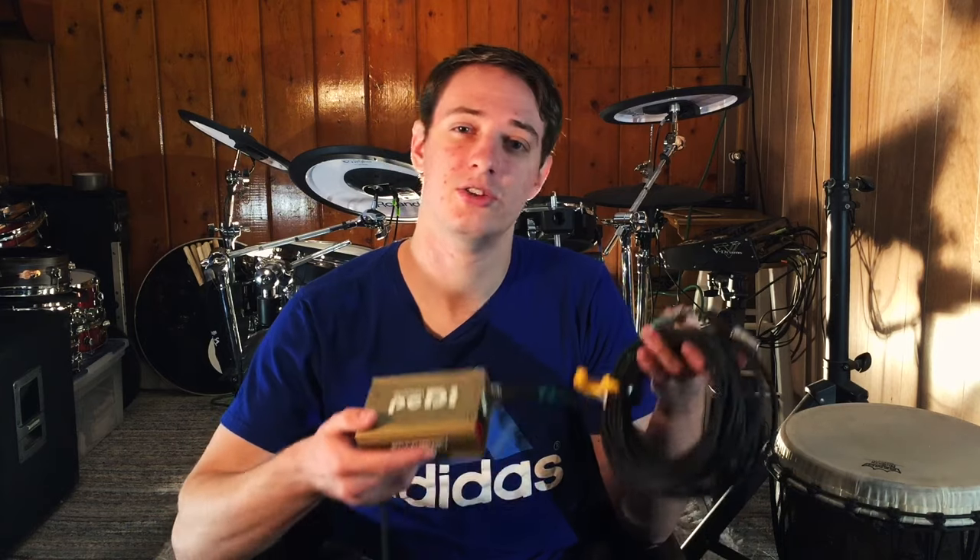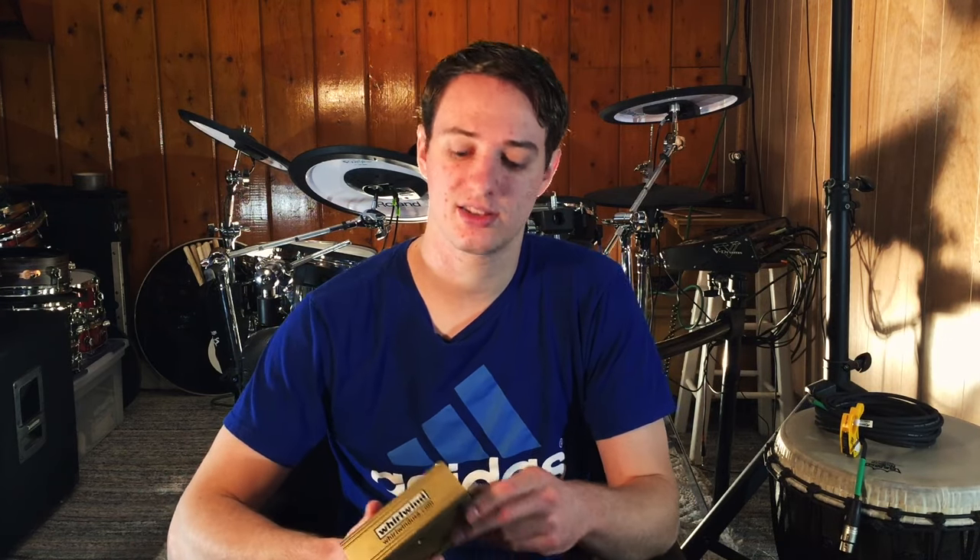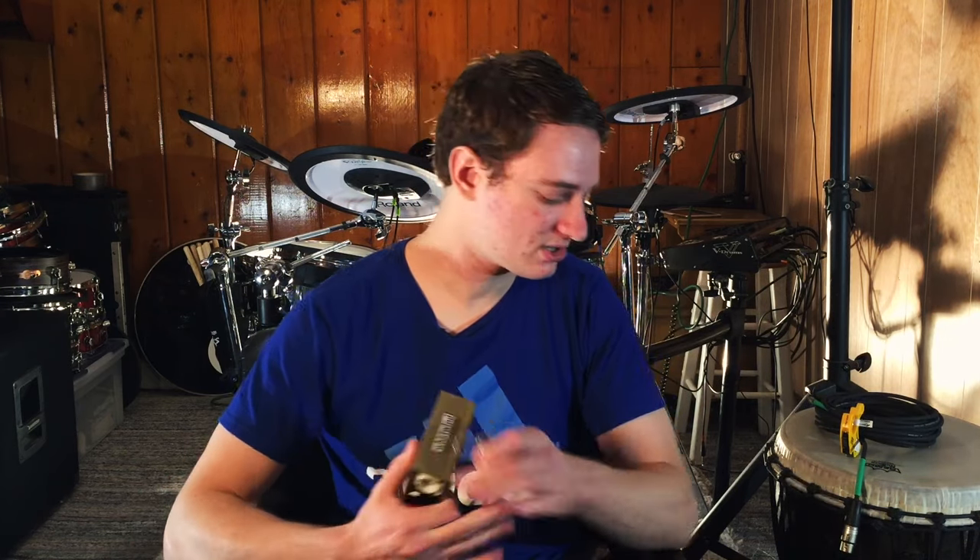The keyboard player does this, the guitar player does this, the bass player does this — everyone does this. Now that you play electronic drums, you need a direct box. And even if you're playing sounds triggered off your laptop such as EZdrummer, you'll need something like a PCDI box. You can plug a cord into the headphone jack of your laptop — if you're triggering EZdrummer 2, you plug into the headphone jack and then plug in your XLR cord. Or another possibility is to get an eighth-inch to quarter-inch adapter, plug that into your laptop's headphone port, and run it into a regular direct box.